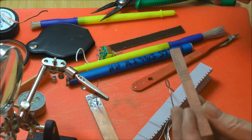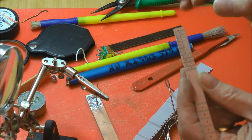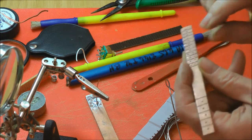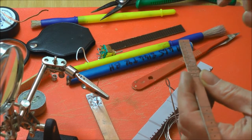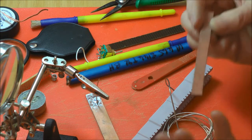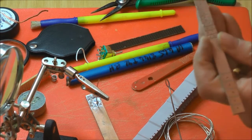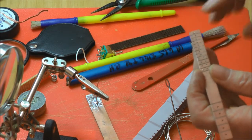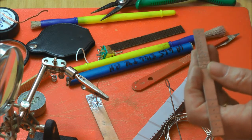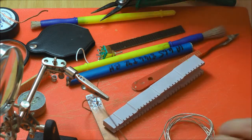But one of the other things you find, on some equipment to work on, the capacitors that you used had very, very fine leads, which were lost in the hole. And I don't know about you, it's a kind of habit that you've got to fill the hole. You don't. It looks better, doesn't it? Yeah, you don't have to fill the hole, and in that situation I would clinch the lead and make sure it's soldered parallel to the board, and it doesn't matter that the hole's not filled, but you kind of keep going in and put a bit more solder in. You don't need to.